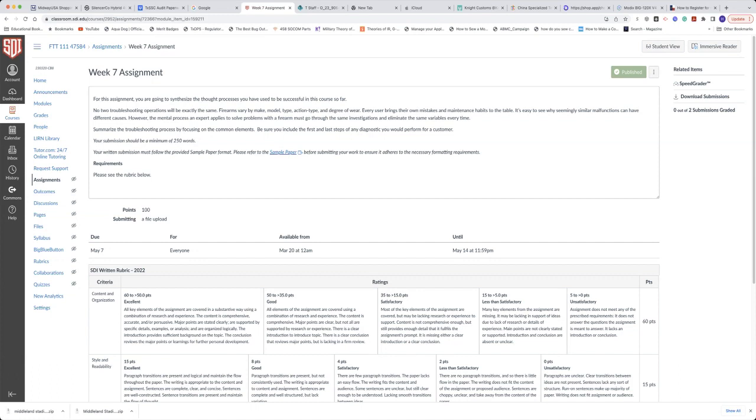So say this is your screw head. You'll chuck it up so you've got a little bit of space, and then you come up with the steel wool, after you've already done your filing. The steel wool will polish out any of those scratch marks, but it's not going to really take off any metal. If you use sandpaper or other abrasives, you'll take off more metal than you really want.